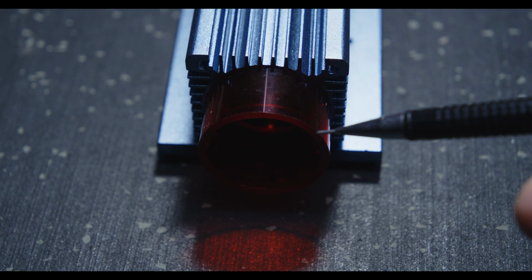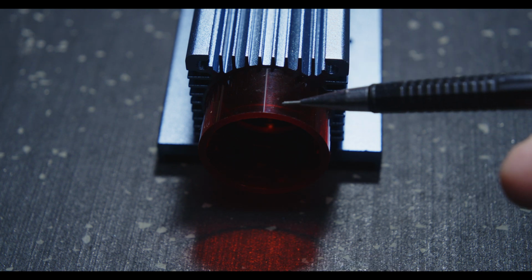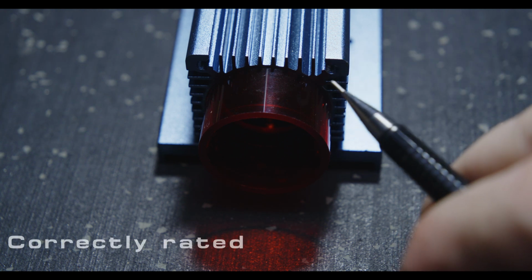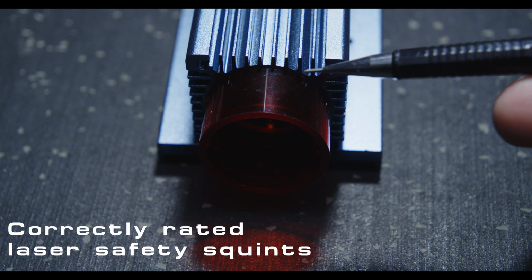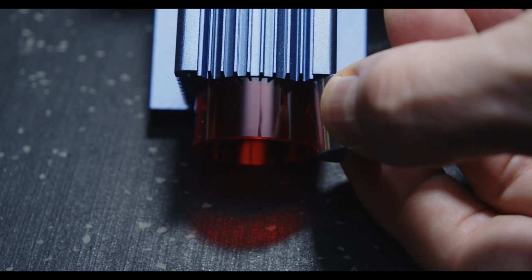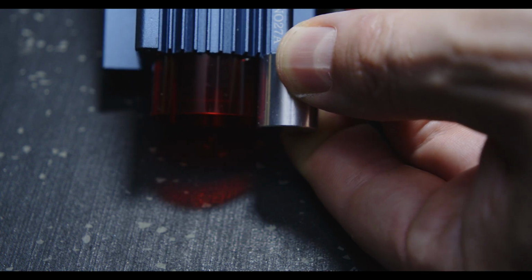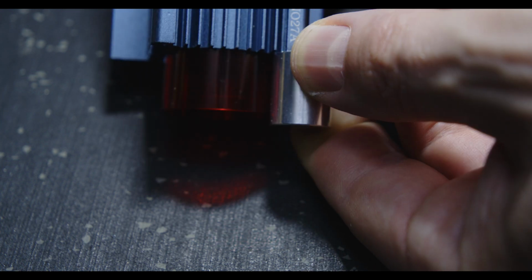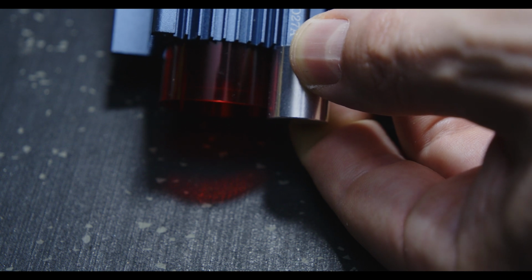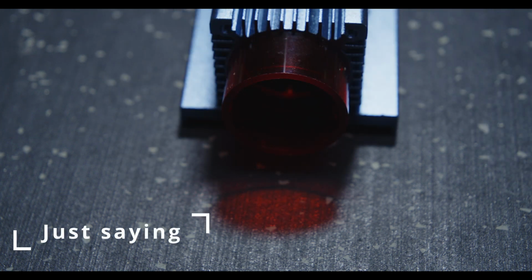As you can see here, this is the burny end with its own little perspex or acrylic filter shroud. By no means is this your ultimate protection. You should still wear your safety glasses and whatnot. But the standoff from the workpiece is only 20 millimeters. And if you look at the stand, I just threw that away somewhere. The way you set this up against your workpiece, you put the stand between the aluminium heatsink and the work. You can see there, it's only about 3 or 4 millimeters off the work. So unless you're looking down parallel with the workpiece, there's not a lot of chance to see the actual raw laser beam and or the work actually engraving. So not too bad. It's quite close to the workpiece. I'm in no way responsible for loss of eyesight.